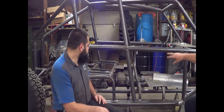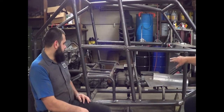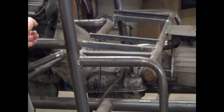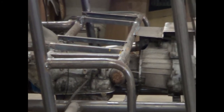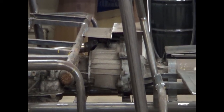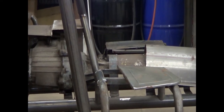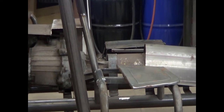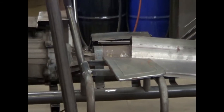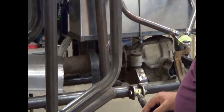Now, what's the drivetrain? We talked about the engine and looking at the differentials. The tranny is what brand? It's a 700R4 out of a square body Chevy with an adapter to the 3.8, and there are different bell housings. And then it's a 241 transfer case, also out of the square body Chevy. The front differential is the rear differential out of a '06 Ford Explorer, a Ford 8.8. Right now it's a 3.40, I think, but I need to change it over to 3.73. So 3.73 gear ratios in the front and rear.